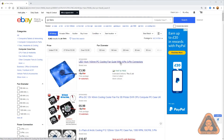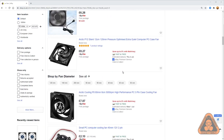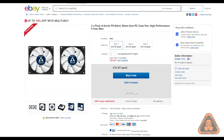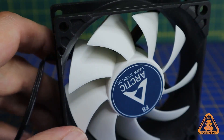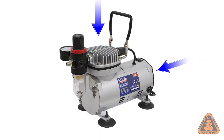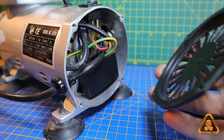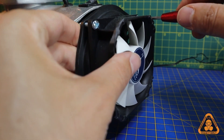Using PC fans to cool the compressor is ideal, but shopping for them can be overwhelming with so many brands and sizes. Starting with size, I found these to be a perfect fit. This compressor needs two fans because after five to ten minutes use, the main body and the piston section get super hot. The fans come with helpful arrows showing which way the blades rotate and where air blows out — airflow direction is really important to get right. By chance, the 80mm fans are not only a perfect size but also share the same mounting points to screw directly onto the compressor's body.